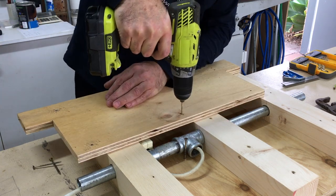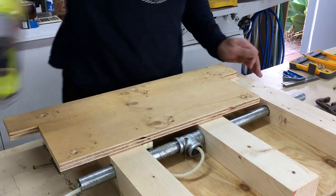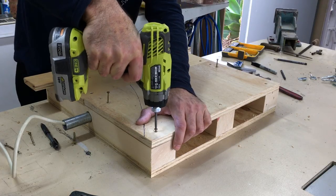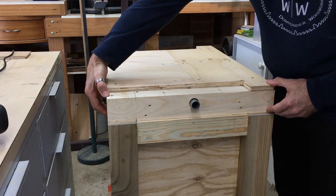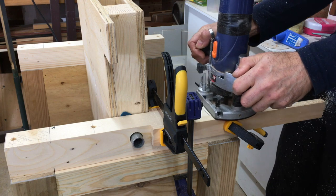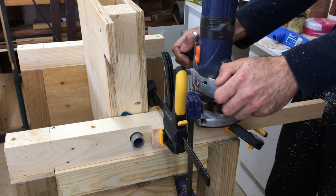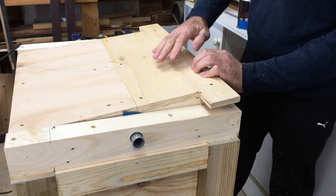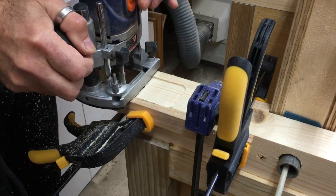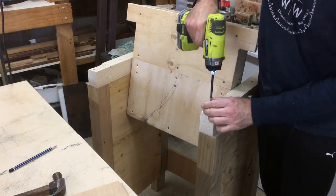I then attached the ply to the other side and had to do this in two pieces because these were the biggest pieces I had left. These pieces weren't glued down so I'd be able to get access to the internal connections and leads. The top had a little bit of play because of the 28mm holes I drilled, so to level it up I routed out 2mm recesses where the top would sit. I also needed to cut the ends off so the top could sit level when flipped over 180 degrees.